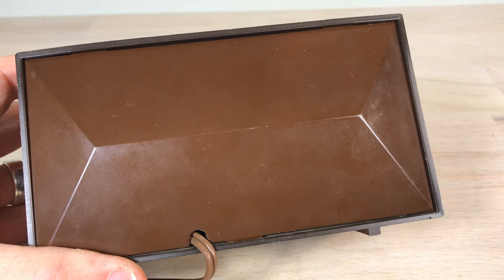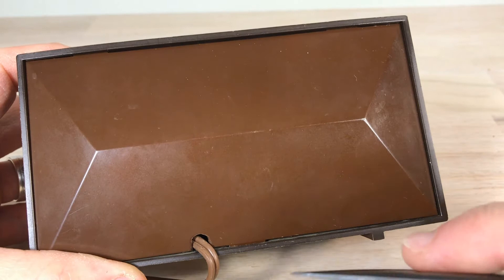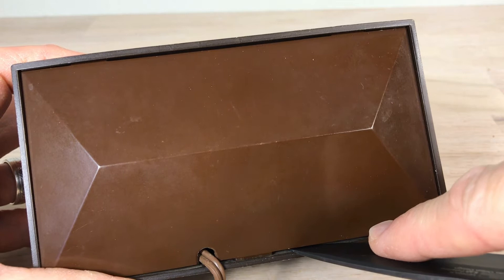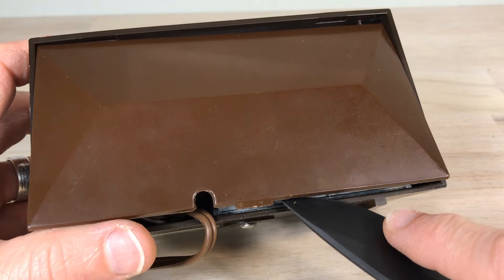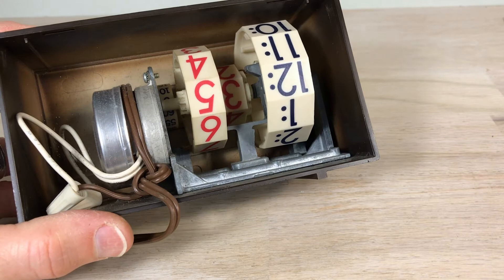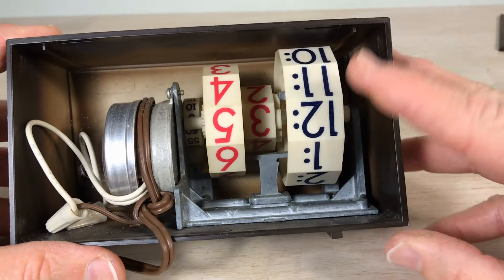You can see there's a tab at the bottom. I'm going to use my trusty everyday-carry blade — it seems like I like to live dangerously taking blades to my clocks, but you need something thin at first and then stiff so you can pry the bottom away and lift it out. I need a better tool probably, but we lift it away and reveal the cyclometer mechanism.